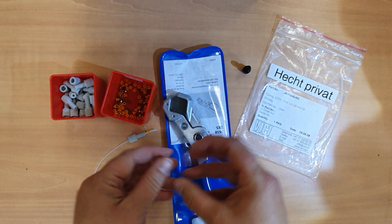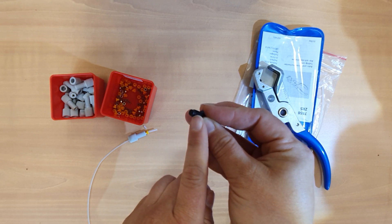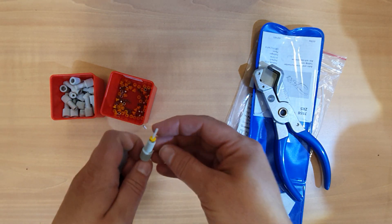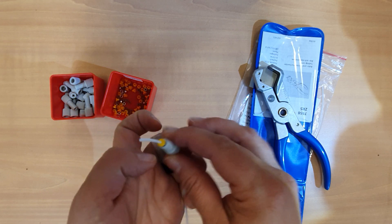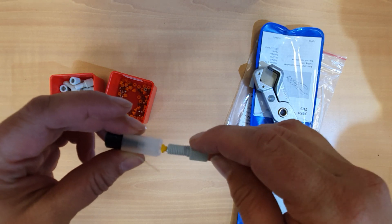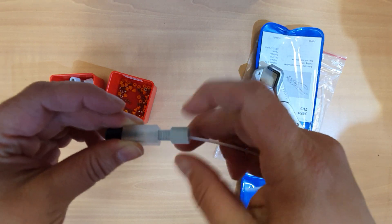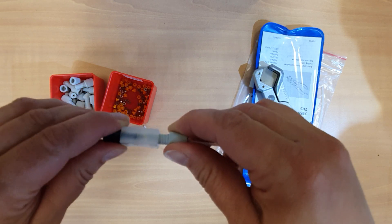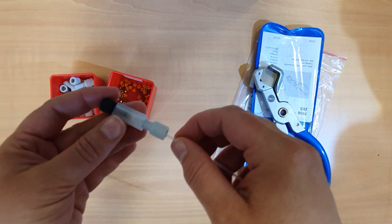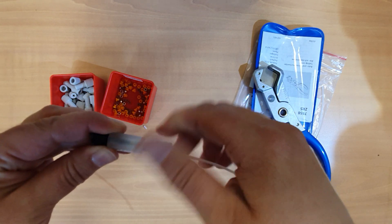To do that, I'm using one of my connectors and one of these stopper pieces which has a flat end. Screw the stopper into the connecting piece. Then we have all the fittings in a row and we're going to slide them all in, pushing the tube so I can feel it running into the black stopper piece. Then I screw down on the fittings until I start to feel just a little bit of resistance. These are finger-tight fittings, so they don't need a lot of pressure. At the end, to make sure it's really tight, give a slight tug in the reverse direction — as long as the tubing doesn't come out, it's usually set into the fitting.